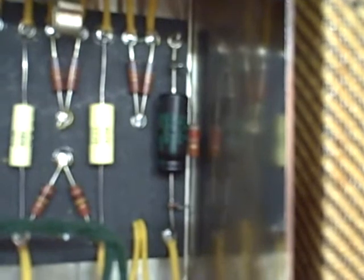I have experimented in the past on other amps with like a 25 microfarad value and I don't really hear too much of a difference, especially playing a Tele or a Strat. Maybe you'll hear a little bit more with a guitar with humbuckers, like a Les Paul or an SG, but 250 microfarads worked out fine for me.